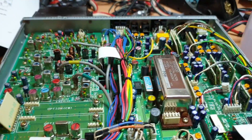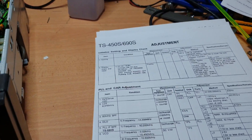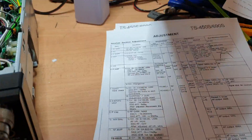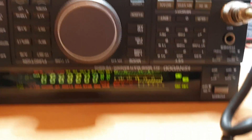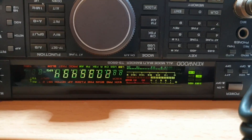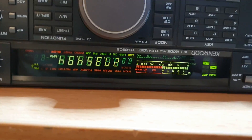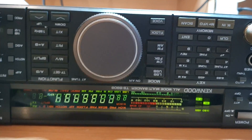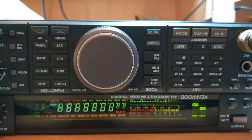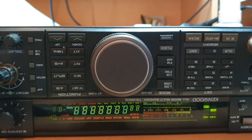We'll pull out the adjustments and work right through — have a look through pages of stuff. In this case we won't obviously go through the PLL and carrier adjustment straight away as that might be fine tuning later. But in the receiver section, I'll put money on the fact that our signal meter reading is not going under about S9, and if I put a tone into it it flips over no worries to full scale. That's what makes you think adjustment.